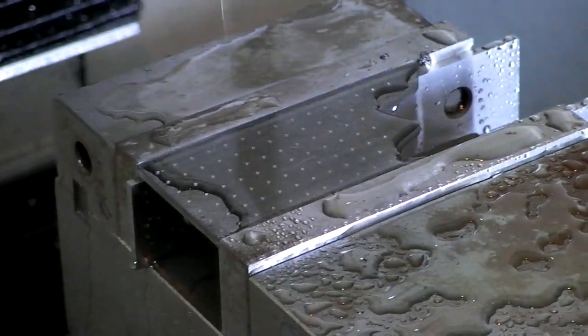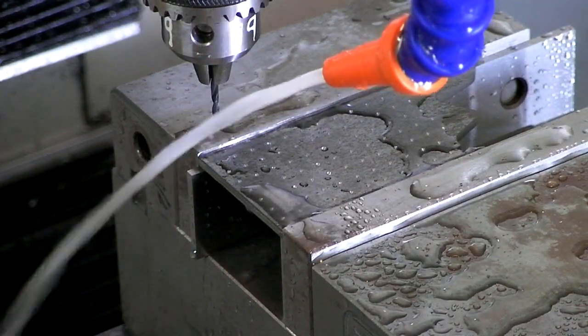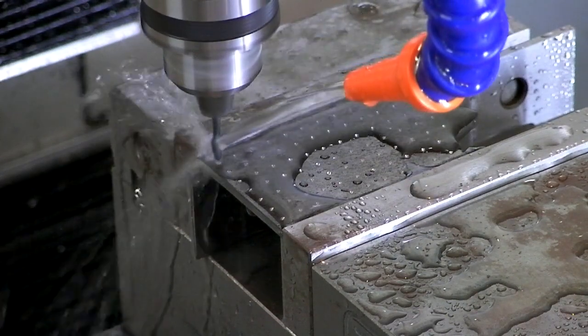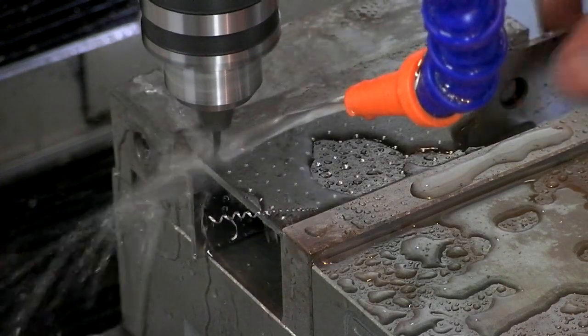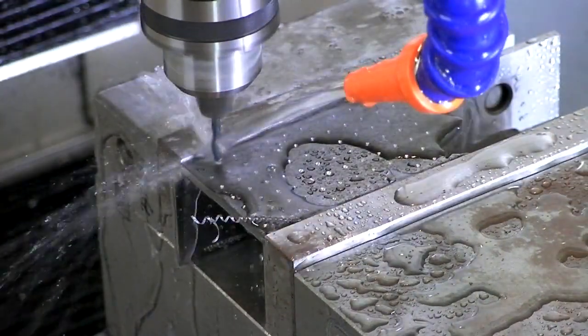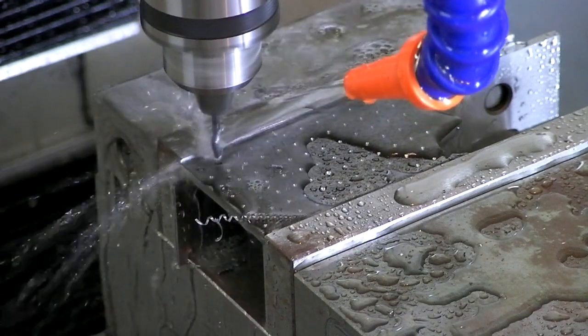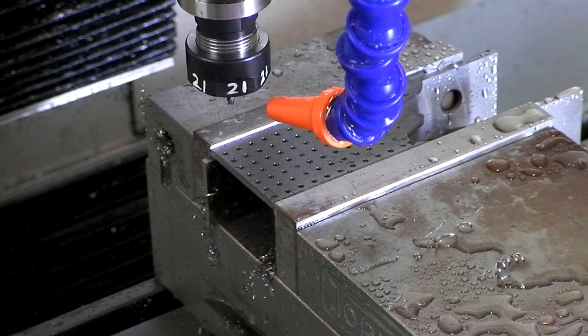I love this machine. Next up is an itty-bitty drill bit — I think it's a 3/32nd drill bit. The next tool to use is a small 1/8 inch end mill, it's a four-flute end mill, kind of a beater one — there's a chip out of one of the teeth, but it doesn't really matter. I'm just creating little pockets for the heads of the screws to go into, because the screws need to sit a little bit lower than the surface.